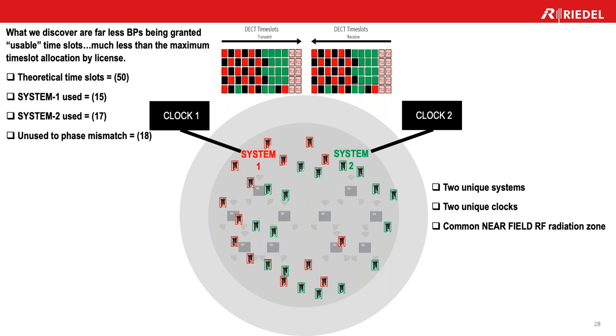Once you move to running a standalone system, the G1 antenna hardware is not sophisticated enough to understand the standalone license or the internal mixing mechanisms that occur in a standalone system. So you can only use G2 antenna hardware if you're applying a standalone license. But you can mix G1 and G2 in an integrated system. Standalone, it has to all be G2. Whereas in integrated, you can get away with some of them being G1. Yep, exactly. Or all of them.